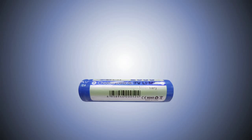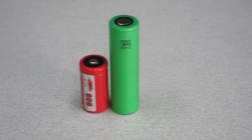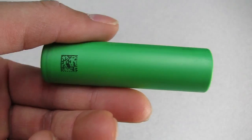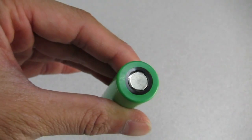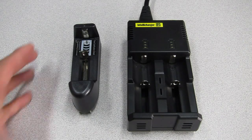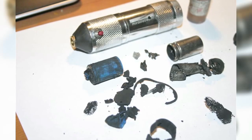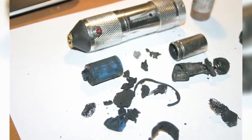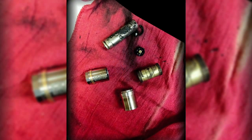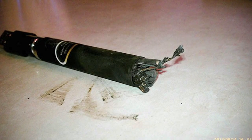Tip 2: Quality above all. Don't get a cheap battery to save yourself a few dollars — it's just not worth it for your safety. Older batteries and those with damaged casing or any other noticeable defects should not be used. A good quality protected ICR chemistry battery is a better choice, and some would argue that IMR battery chemistry is safer due to it being less volatile. Just like the batteries, you want to get a good quality charger, as a bad charger can overcharge your battery, making it unstable and increasing the chance of it overheating, venting, or even exploding. A fully charged IMR battery should be between 4.15 and 4.20 volts. Anything above 4.25 volts will shorten its life and instability becomes a concern. Above 4.5 volts is a recipe for disaster.